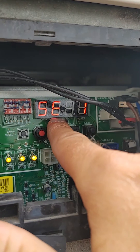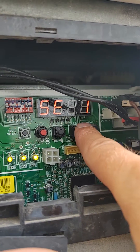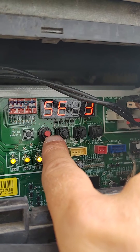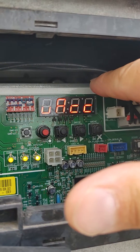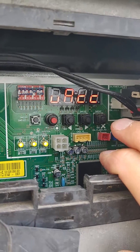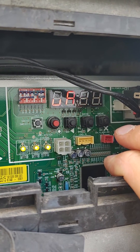It will go to the Service SE1 menu. Toggle to SE3 and hit the red button again. After you hit the red button, you will hear valves start opening in the outdoor unit. The vacuum mode is set and you can work on the unit.